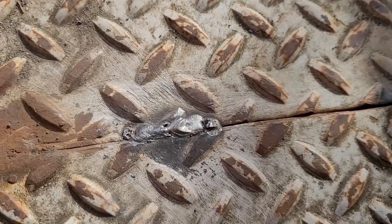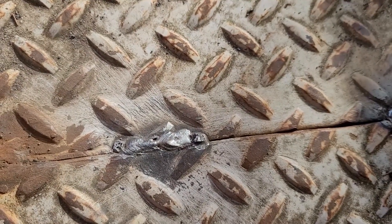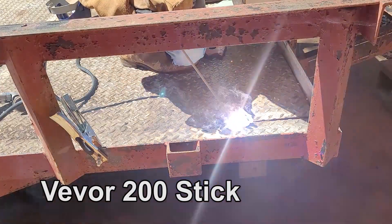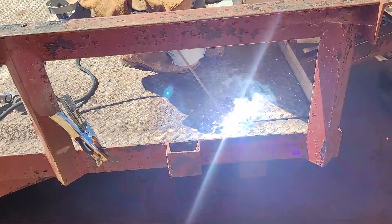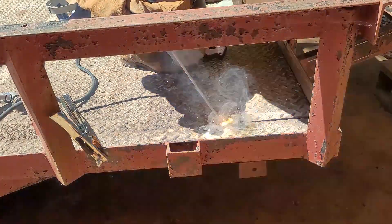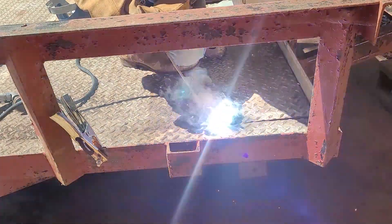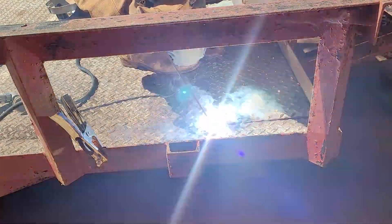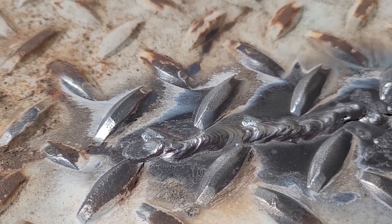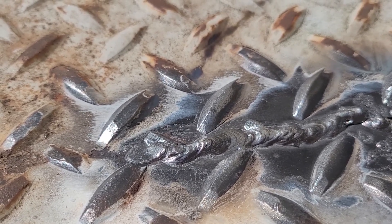So it's not too bad on this dirty trailer metal. You can see I got a little bit of porosity right here, but it's going to take some fine-tuning obviously. Stick — you can see it's doing pretty good. I'm not that great a stick welder, but it's getting pretty good penetration. It does seem like it wants a lot more current when you put it on stick mode.